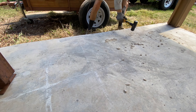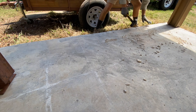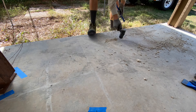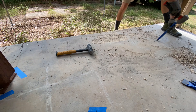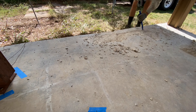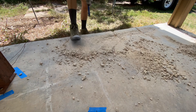You'll notice here that I started off the demolition with a handheld sledge hammer. You always want to start with a handheld tool — you don't want to go right to power tools because you want to know exactly what you're working with before you get out the big guns. These little blue chisels are called cold chisels; you can pick those up at home improvement stores. I really defined the borders of exactly where the rebar was using just a handheld hammer and some cold chisels.